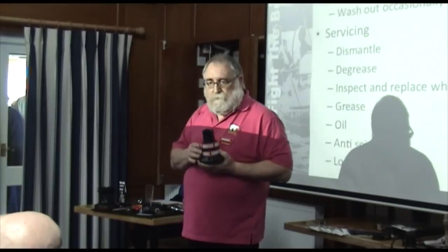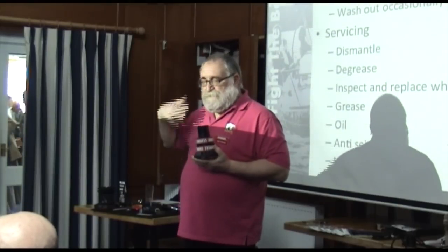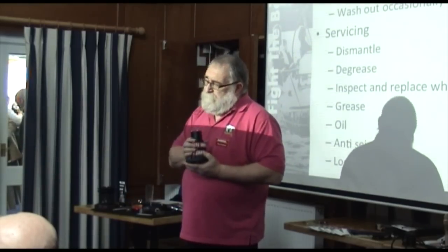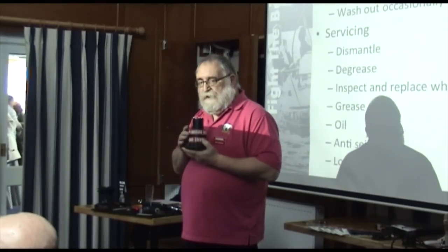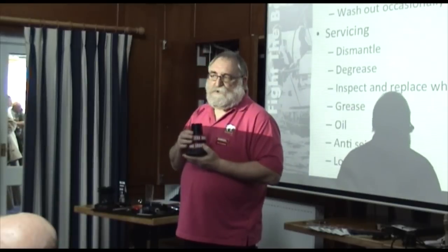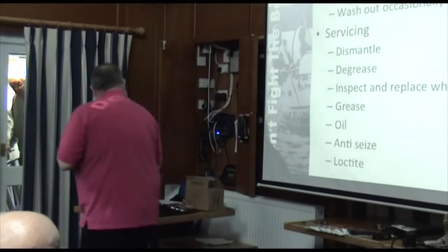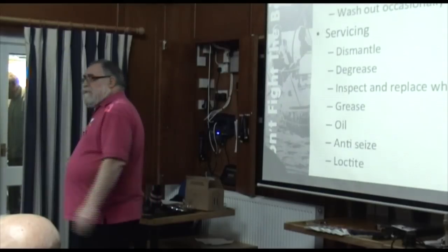You know, big metal in most people's winches. But now we've brought our experience with America's Cup, Volvo, and all the Grand Prix stuff, the TP52s, back to our basic winches, and we're using plastic self-lubricating bearings. Theoretically, you don't need to grease these. Actually, if it's my boat, they're going to get smeared grease because it won't damage them. Why not? I've inspected everything and I'm happy with it.